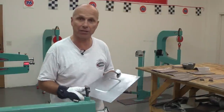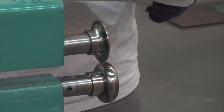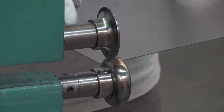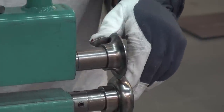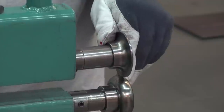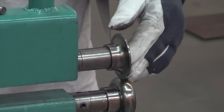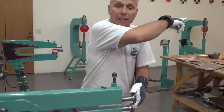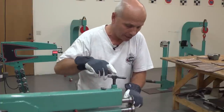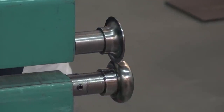Here is the next profile and combination — this is endless, we are just touching the iceberg. I still have the same die on top but a round profile on the bottom, placed on the side. I also want to show you that depending on the panel you can work on this side or that side — it depends on where the sheet metal extends. If you move the shaft over to one side you can have the sheet extend toward the wall over there, and here you can see how it moves down as I set it.